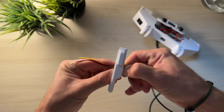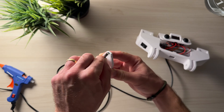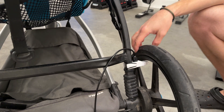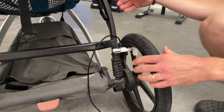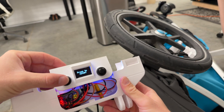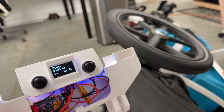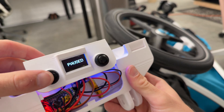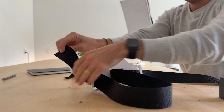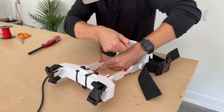Okay so let's get back to the video. The last step here was to assemble the wheel sensor — just a little case that houses the hall effect sensor. I wanted to keep this really simple while also allowing the sensor to be as close to the wheel as possible so that it could count the wheel rotations with minimal misses. I just used an o-ring to attach it to the frame of the stroller — the clearance is super tight. I could then flip the stroller on its side and start to spin the wheel to make sure that the system was counting the wheel rotations properly. As I spin the wheel the distance updates accordingly, and note that the pace measurement will only update once every 45 seconds. I could then attach the waist attachment — that slightly curved piece — and use some two-inch webbing to form the waistband, along with those red cords which allow the system to flex up and down as I run but not create hard stops that will jolt the stroller.